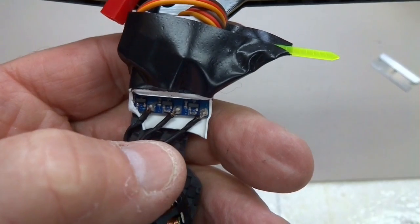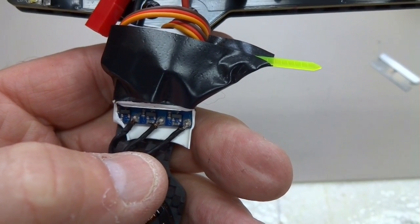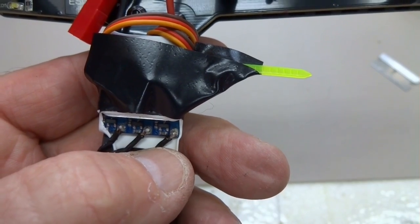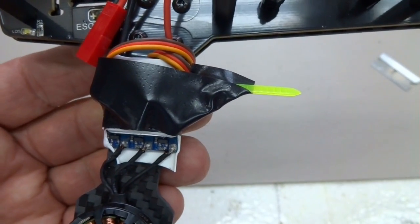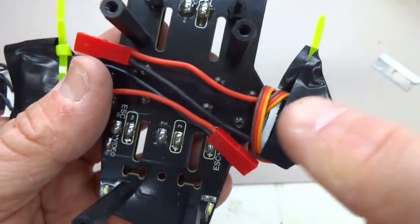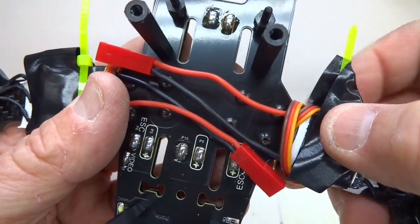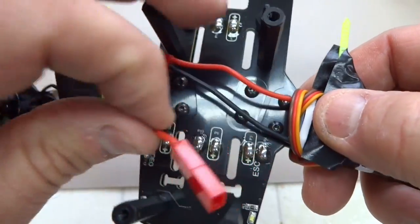If you do it this way, when you calibrate your motors, you're going to find 2 of them turning the wrong way, and you'll have to redo 4 solder joints. Not a big deal. It'll take like 2 minutes. Okay, while you're there, go ahead and take your servo cables, wrap them around the ESC, and just use some black tape and tape it out of your way, because next we're going to be soldering these power wires.